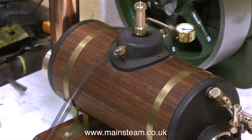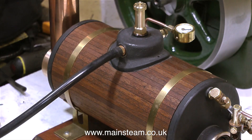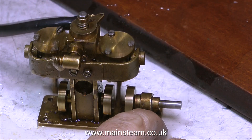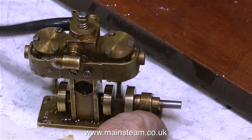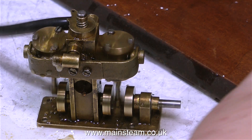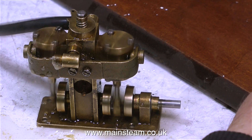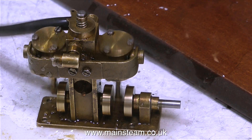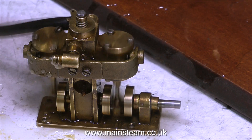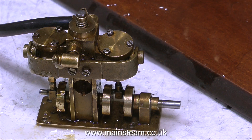I connected a piece of silicone rubber piping onto the boiler's steam outlet and connected the other end to a Cheddar Models Puffin. After a while longer, once the pressure built slightly, the little Puffin engine ran very well in both directions. These are great little engines for model steamboats and they don't need much pressure to run. It's very wet steam - most of it's water that's coming out of the exhaust. So in your model steamboat, if you use the Cheddar Puffin engine, you can use a small ceramic burner with a small boiler.